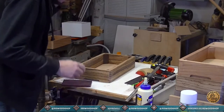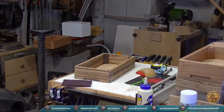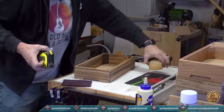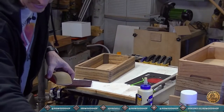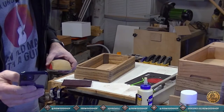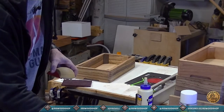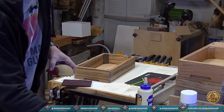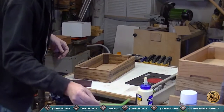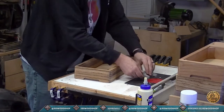Okay, so I've decided I'm going to do the roundovers on these first. If I open up more of the pores after I have already done the grain filling, that would probably be counterproductive. So it just makes sense, I think, to do it now. Oh, okay, no big deal. Yeah, so anyway, I think that's the way I'm going to go with this, which means we need to go over here to the table and put in the little roundover bit,